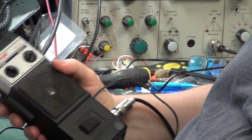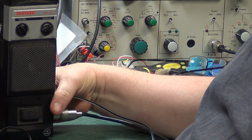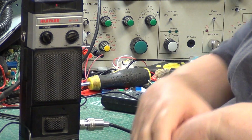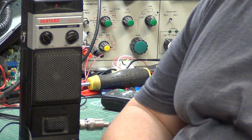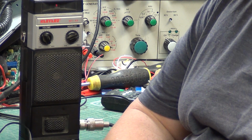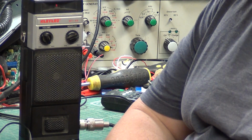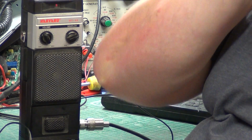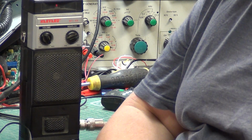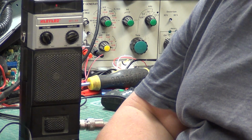So, as far as the receiver goes, the receiver is pretty abysmal. Although we have the sensitivity on paper, it's a bleedover box. I've got RAF Cranwell 4 miles down the road, and I can hear the ground radar interfering with Mr. Chippie. We've only ever had that on one other radio, which was a Signal 1001, which is a cheap version of a JWRM2. So, abysmal receive.